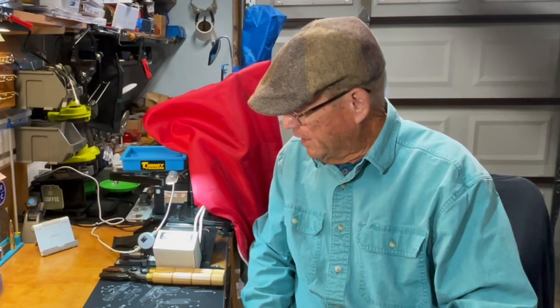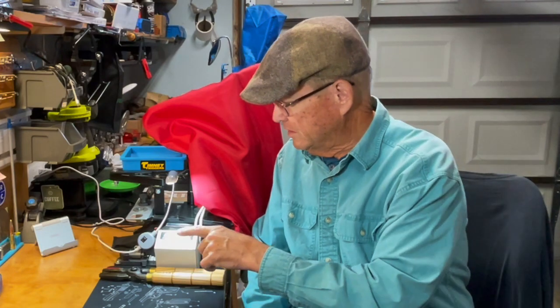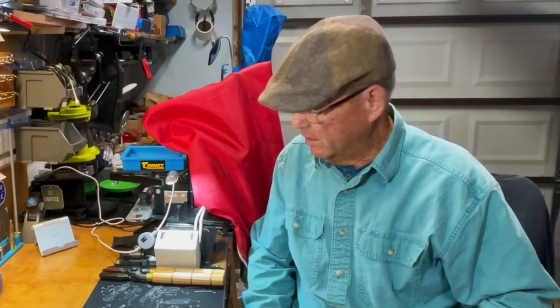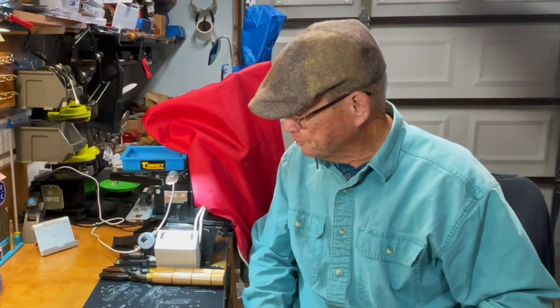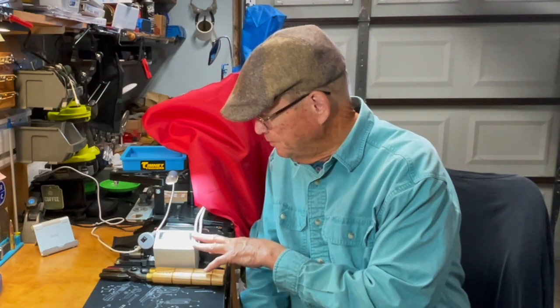And it's Moldy Monday again. This is going to be episode 23. And I've got another Saeco mold for you today. This is another for 10 millimeter or 40 Smith & Wesson. This is the Saeco 624-3. All right, it's rated at 170 grain, truncated cone bevel base type of bullet. Mine actually come out to 172 grains as cast, with the alloy that I use with it.